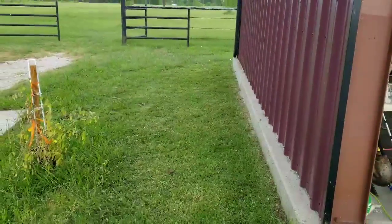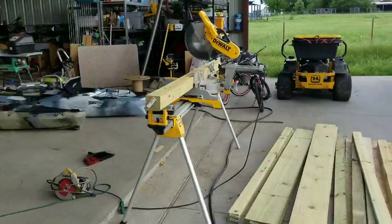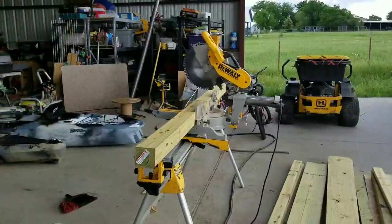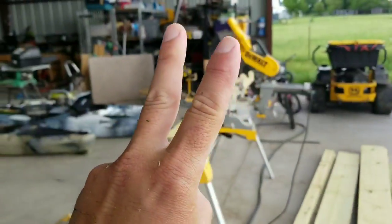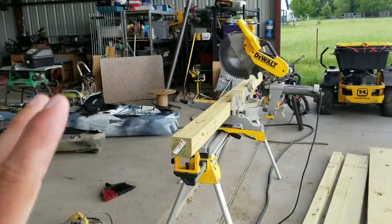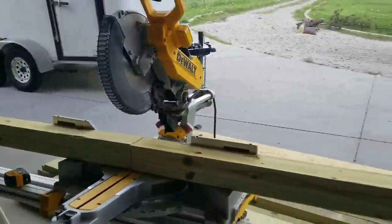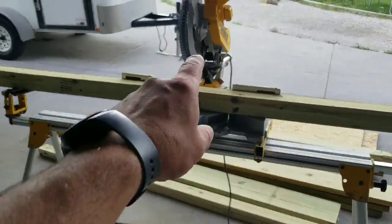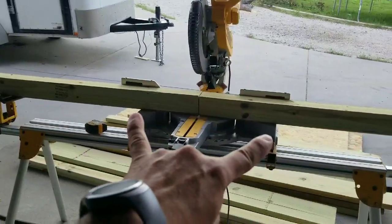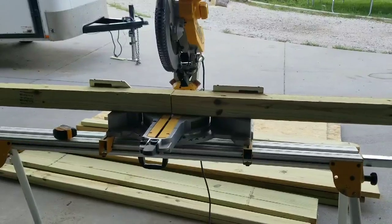right there. All right, so we're gonna cut our 4x4s, which is gonna be our base. We're gonna cut them all at 4 feet, so we're gonna cut one for each side, so that's 2 4x4x8s, and then we're gonna support it in the middle with another 2. All right, I'll show you how I do this. I went ahead and chopped this one in half, so it's 4 feet on each side. And then I'll show you the next video.